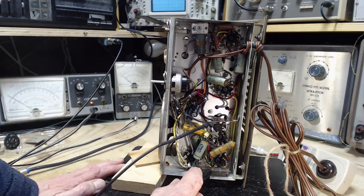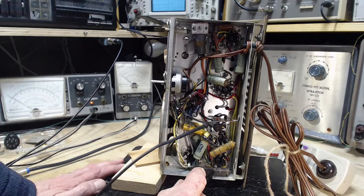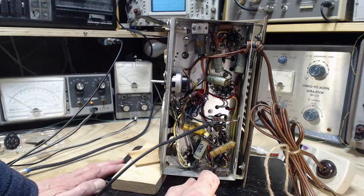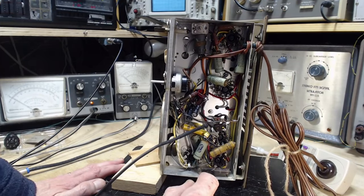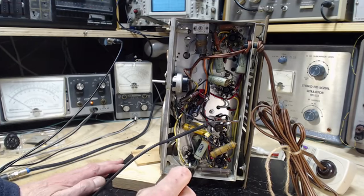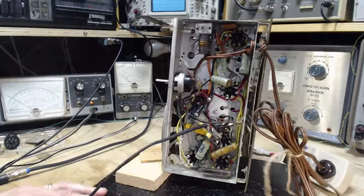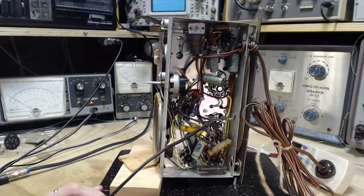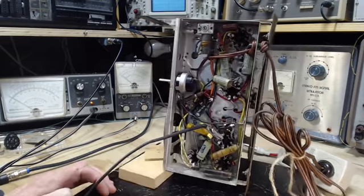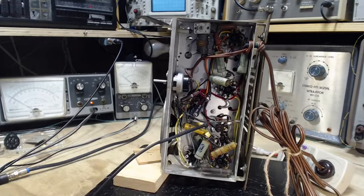He's hooked up to pin number 2. On these tubes, often pin 2 and pin 7 are the heaters. It's definitely on pin 2 here. There's nothing else hooked up to pin 2, so whatever gets to pin 2 has to go through this. We come over to this next one. I think it's pin 7. The resistor is hooked up to pin 7 over here. Oh, now that's the rectifier, right? Pin 7 on the rectifier.